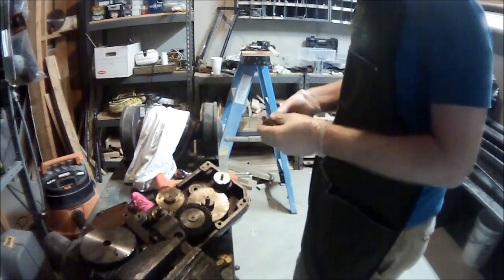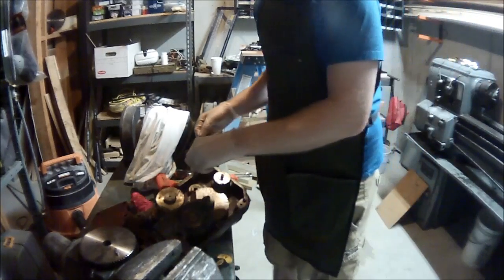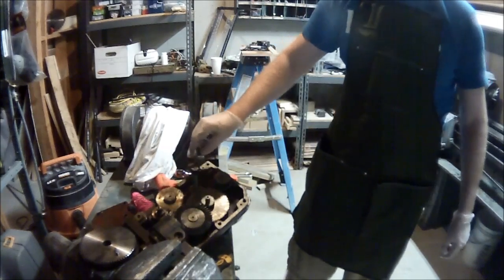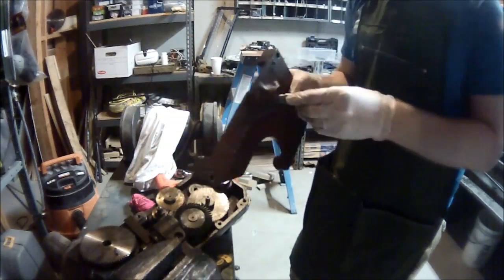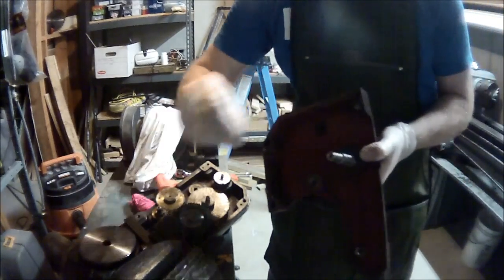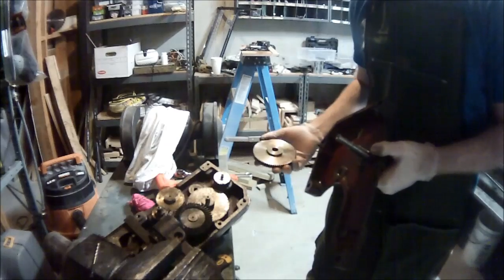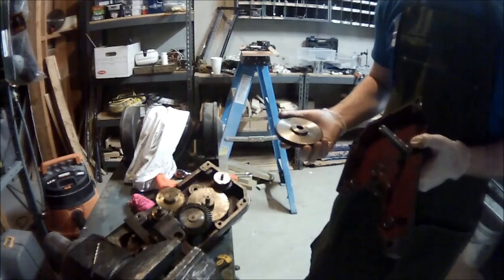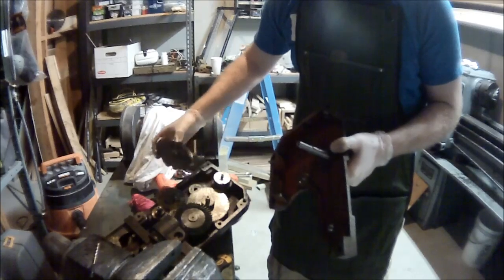Here I have to reassemble it. It's got three levels, so the first piece actually fits in a bushing into the apron, and it all has to start in the front. The pinion sticks out, then behind that is this gear. The keyway goes in first and then the gear goes in secondary. I spent a moment trying to work out which way it went and concluded that the flat side was against the outside piece, just based on wear.